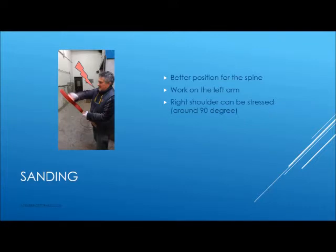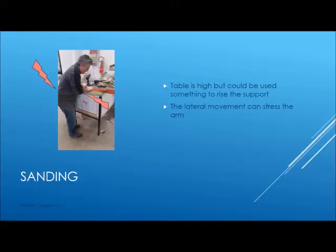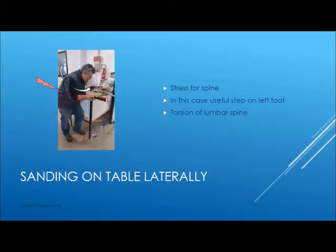This is a better condition with the wood kept by the left hand while the right is standing. Standing in that way can stress the right shoulder anyway — as you can see it is very high. Standing in this upper position is not so bad but the table should rise a little bit. There is critical stress on the lumbar spine standing in this posture for a long time. Standing laterally in parallel to the table can create a torsion to the spine that can also cause lumbar stress. The positive factor is the wooden block under the foot, which keeps better curves on the lumbar spine.